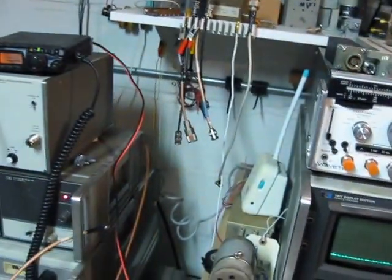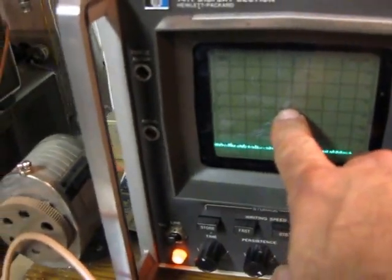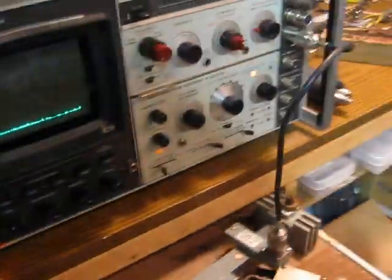So we're in receive mode, and we've got the 817 on FM, just for ease of whatever. Did a test before, and center scale here is 10 milliwatts, so we're going to want to see this come up 22 dB, plus or minus whatever jumper loss I have.